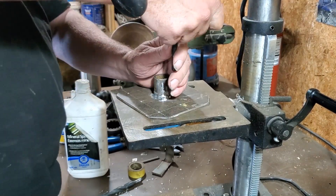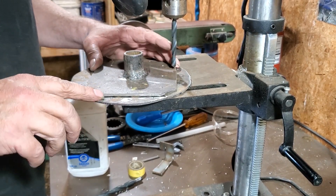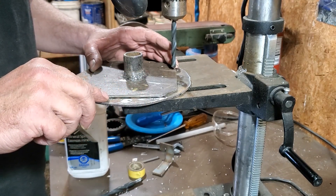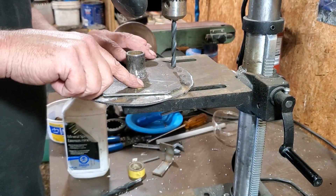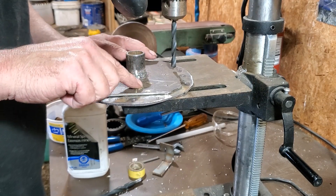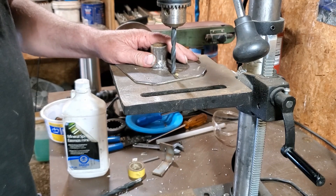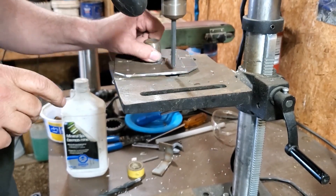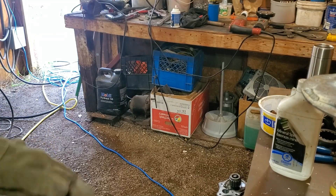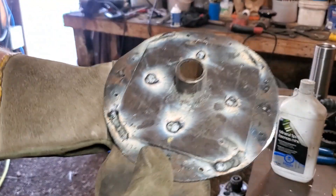That would make one ragged hole. See how close the plate is to the holes? So if we just weld along here, our weld is going to interfere with these holes. What we're going to do is weld the corners, and I'm going to drill holes here and we'll make plug welds — fill in the hole with weld — so we won't have the heads of the screws fighting with the edge of a weld. So we drilled four holes, made some plug welds, and welded it on the corners. We'll get that cleaned up and move on to the next step.